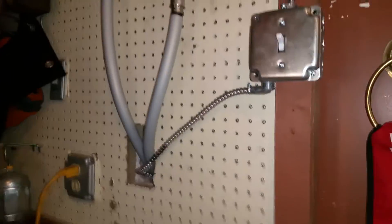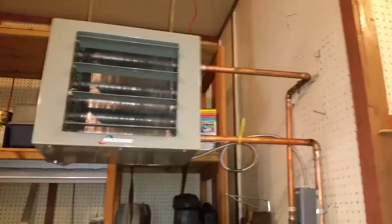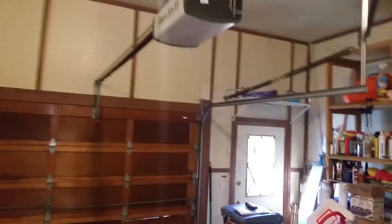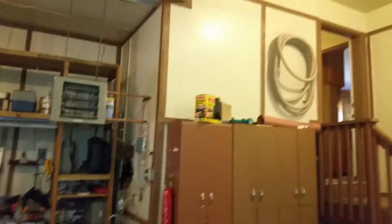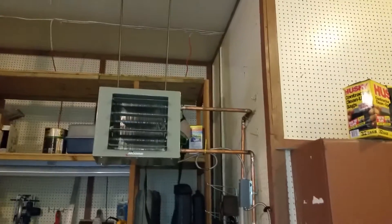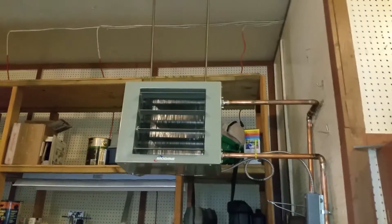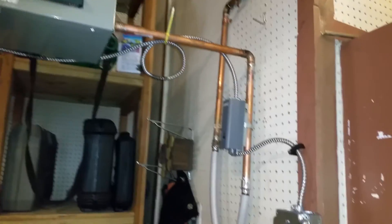Let's see — that's basically it. If you want to shut down the fan and not have it go at all, just turn it off. It's set so when the aquastat senses 180-degree water coming, it turns on the fan. Right now it's been in one day, so who knows — we have a pretty decent sized garage. I did a couple of calculations based on what they told me. I don't want to keep the garage 70 degrees; I just want to keep it maybe 55 to 60 so it's not freezing cold. Hydronic Modine heater, garage install — so far, no leaks and it's working.